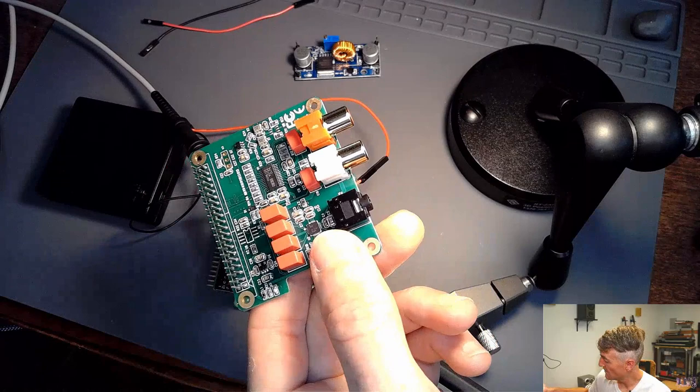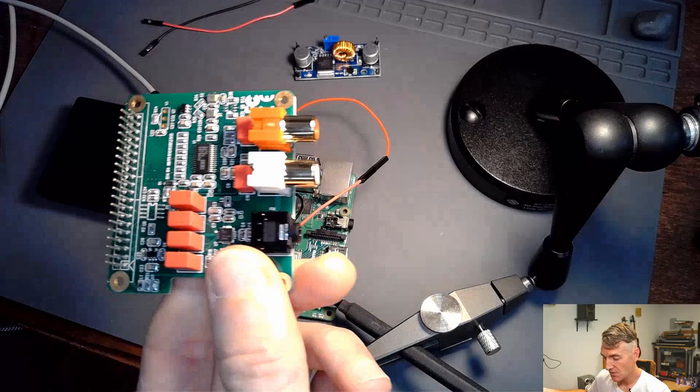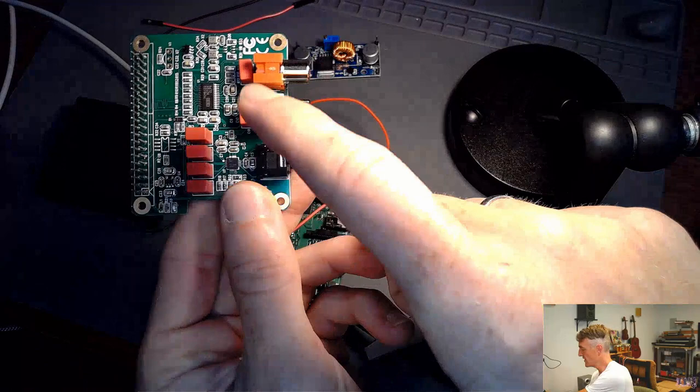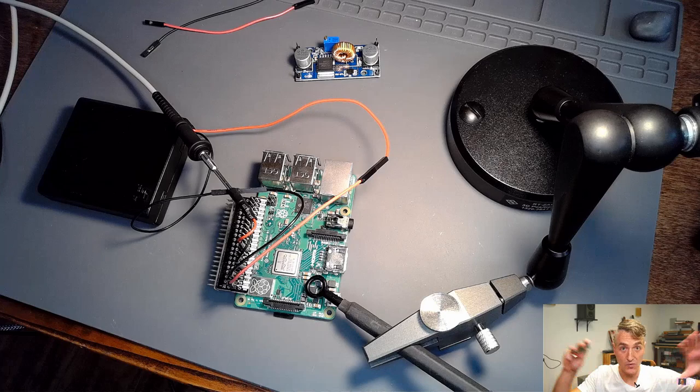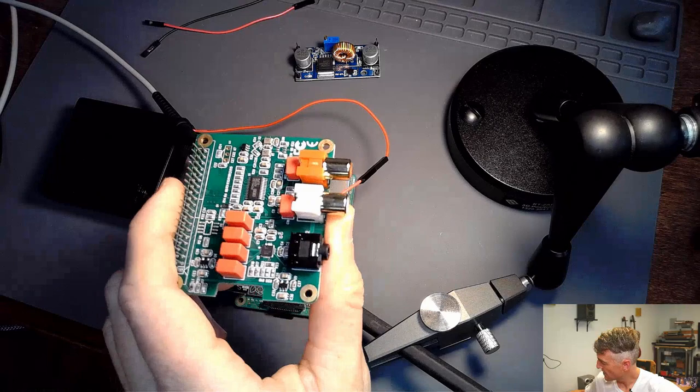So it has the hiss unless you somehow isolate the power supply of your digital analog converter from the Raspberry Pi, then you're going to have that hiss. In the chat, they're saying they highly doubt the Pi's switch mode power supply is the culprit, and they're guessing that I had a ground loop and was experiencing ground bounce. I could believe that with my wild circuit design, but when I'm using the hat, I have trouble thinking that I would be able to improve this ground loop any better.